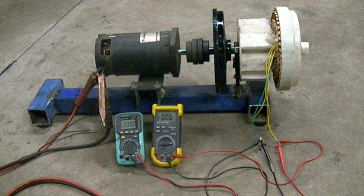The flywheel — I went for the smaller one, which is actually off a Volkswagen 1200 motor. It's spinning very freely and even with the generator on it takes a while to wind down. I've removed all the seals from the bearings, washed all the grease out — both in the motor and the generator — and filled them up with a light oil. Which is why you can hear the bearings, but that's to make sure things are freewheeling as well as they can.